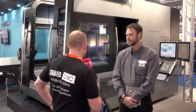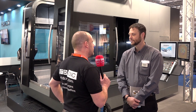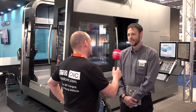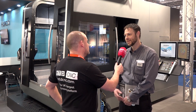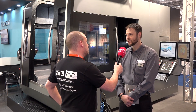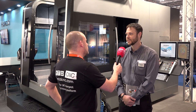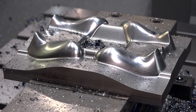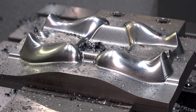Cutting feed rates — I see 39 meters a minute. Can you explain how fast that really is in general terms? For the most part you don't need that much speed, but when you do, you do. The way we spec the machines is being able to hit that feed rate with the maximum weight on the table, so you can put heavy parts on and still achieve the fast feed rates — especially helpful in the mold industry.